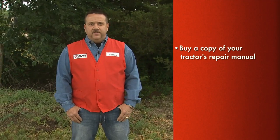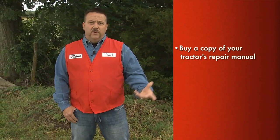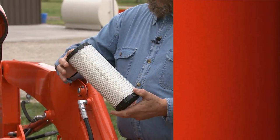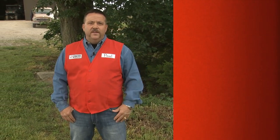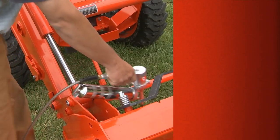If you're still on the fence about doing your own machine maintenance, start with a few of the things we showed you today. The single most important investment you can make is to buy a copy of your tractor's repair manual — most tractor manuals have clear instructions with diagrams for routine maintenance and part replacement. Don't be afraid to ask experienced neighbors or come down to your local tractor supply store. Having a spare air filter on hand is invaluable — if yours fails, your tractor's a one-ton paperweight until you replace it. Same goes for fluids: keep them on hand to top off as needed. If you've got a grease gun and grease on a shelf, you'll be a lot more likely to keep your equipment greased. Spending a couple of minutes every month can help your tractor last much longer and save you money in repairs.